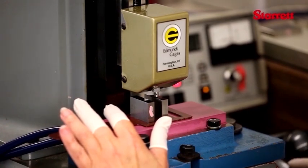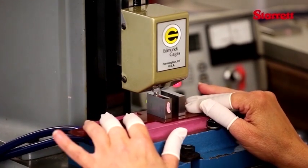It would be very unusual to use grade 00 blocks on the shop floor. The accuracy of measurement is only slightly improved over grade 0 tolerances and has a greater cost. This additional cost is justified when reducing measurement uncertainties is very important.